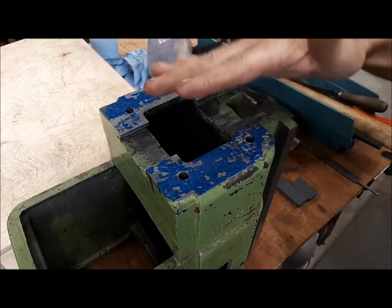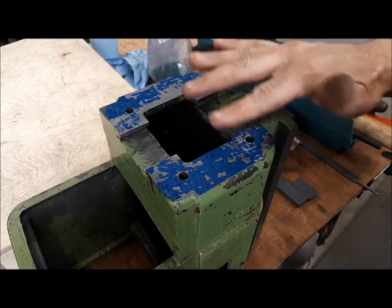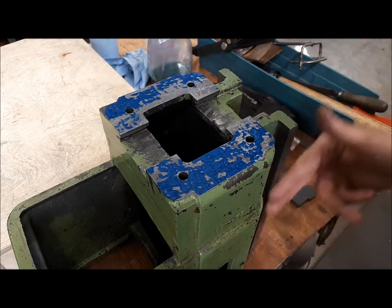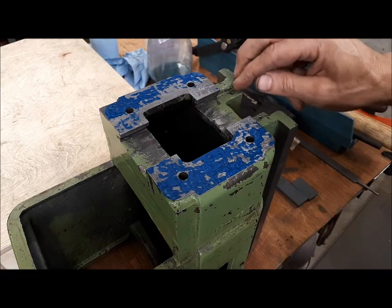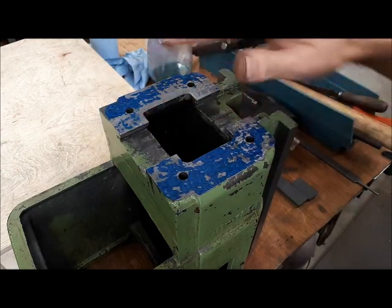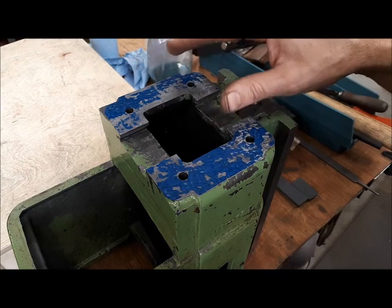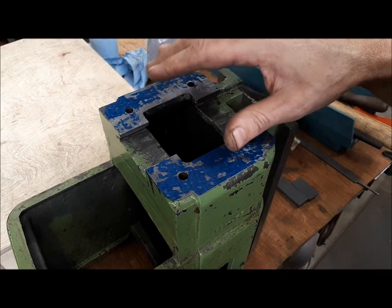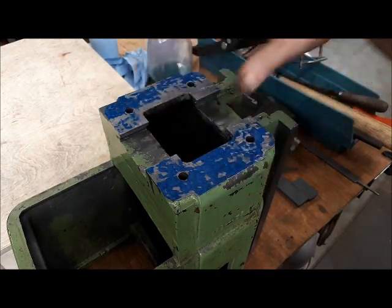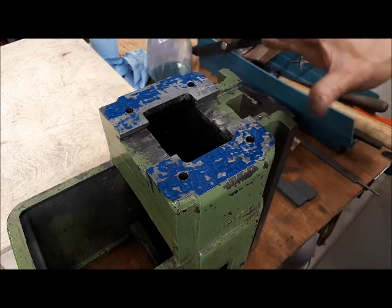So this is the spindle head mounting surface. Since the last thing I filmed, I did one more set of step scraping just to get the fixed side of the column straightened up, and it's come in nicely. Now all I'm doing is working on this surface to get it flat. This is just a mounting surface for a machine part — not a bearing or anything like that. I think the book calls out for maybe 12 points per square inch, so I'm just going to do a little scraping to get this in the ballpark of being flat and then do some more verifications and fine tune it if I have to.